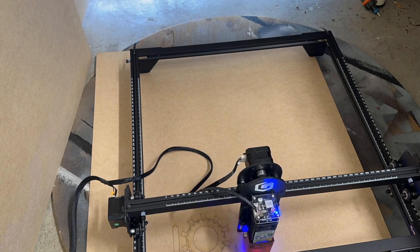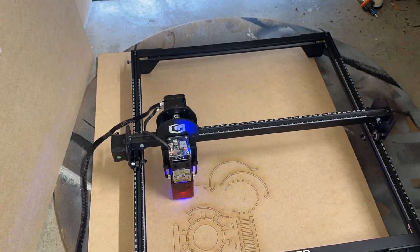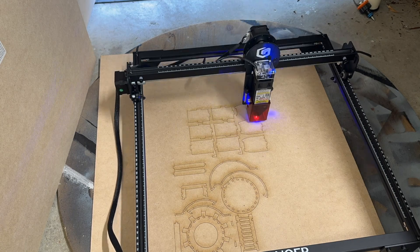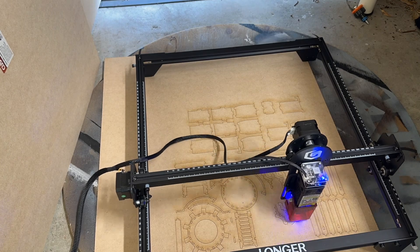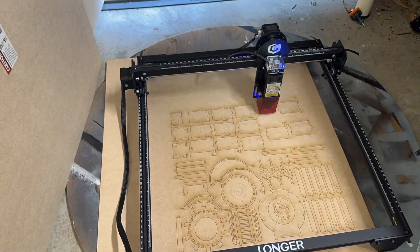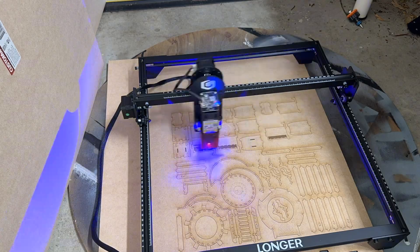Operating the machine, you want some good ventilation. I was doing this in my garage with the doors open and a fan running, but I could still smell the burning. I get that's because I was doing a lot of cutting — maybe if you're doing engraving the smell wouldn't be as intense. But it is quite potent, so make sure there is good ventilation. Also make sure you're monitoring the machine and watching it, because there is that risk of fire depending on what material you're using. If you try different settings like I did at 100% power trying to engrave, you're gonna have a bad time — there is the potential that material could catch on fire.